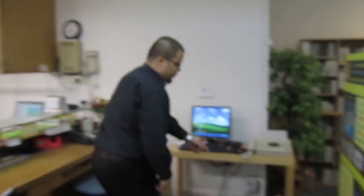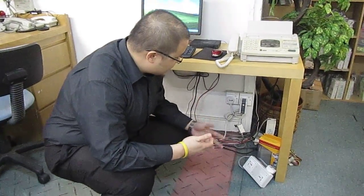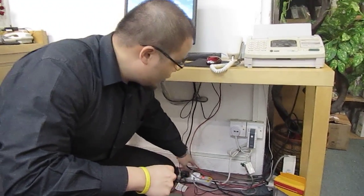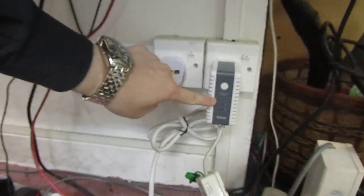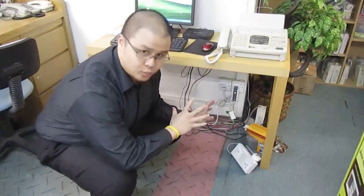Moving on to the next workstation, the Shure Streamer has been removed. In this particular workstation, we actually had a twin wall outlet, which means the PLC adapter did not have to share the same wall outlet as the interconnected equipment. The power bar for the interconnected equipment has its dedicated wall outlet, and the PLC adapter is plugged into a different wall outlet. Even though we followed the expert's recommendation, you can see that the PLC adapter's LED light is actually showing red, indicating that the connection rate is subpar and very unstable.